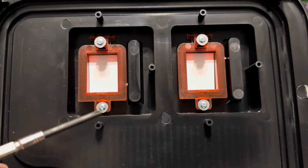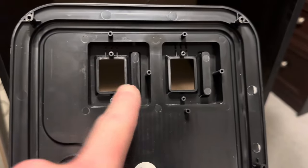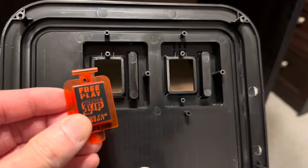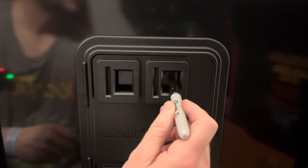The reason we have the smaller screwdriver is to remove these four screws. Once you remove the screws, these will pop right out. It'll be simple to mark the holes — you don't need a tape measure. I learned this trick from Bea from ConsRUs: set it back in the front for a second and take your Sharpie and mark a hole right in the middle of each square.